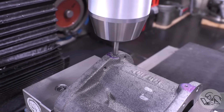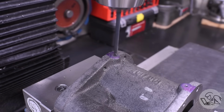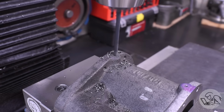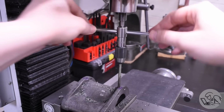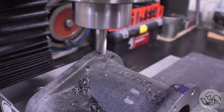Cylinder drains are opened when you first start the engine because the cylinder is cold, and so the steam hitting it condenses into water, and you need somewhere for the piston to be able to push that water out of the cylinder so you don't hydrolock it. You've seen locomotives starting up at the station, and there's steam and water pouring out of the bottoms of the cylinders. That's actually the drain cocks that you're seeing. Once the locomotive is running under speed, those drains are closed, and you don't actually see much for steam coming out of the engine anywhere.